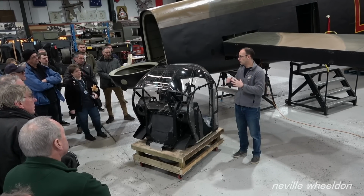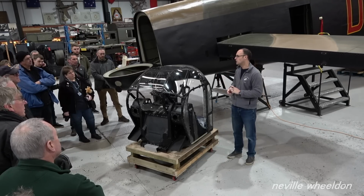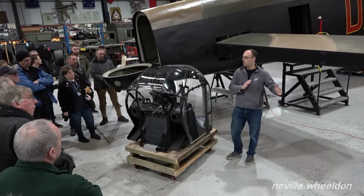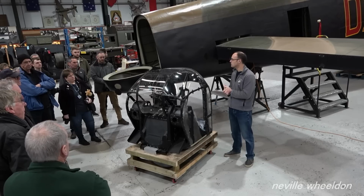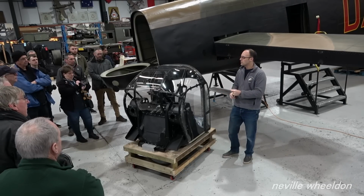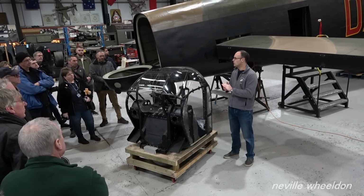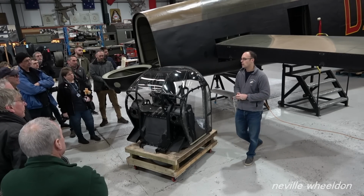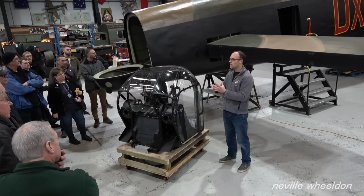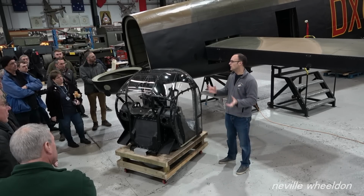We decided from the survey that the parts needed to be hit first were the wooden parts, so the fins on the aircraft which have a wooden leading edge, the rudders and the wingtips which have a wooden leading edge as well. So those are what we did in the first 3 years of the restoration work. We're now just starting year 5 of the 10-year plan, and a couple of years ago we decided that if we're going to make this work, taxiing and restoring, then we've got to hit this in a slightly different manner. So we decided to look at ways that we could continue to taxi the aircraft and also make progress in the restoration. So we needed donor bits to put on the aircraft to taxi in the summer while we took our piece off, restored it to airworthy and swapped it back.